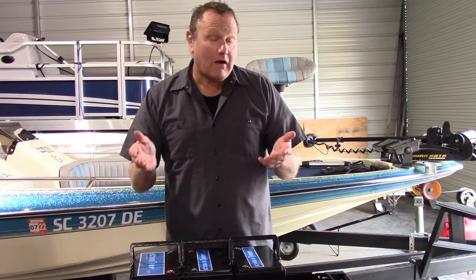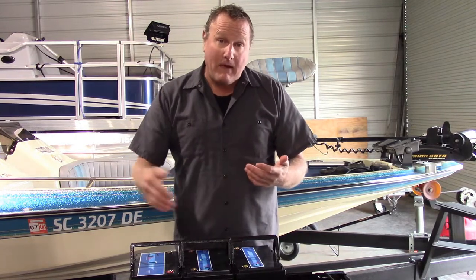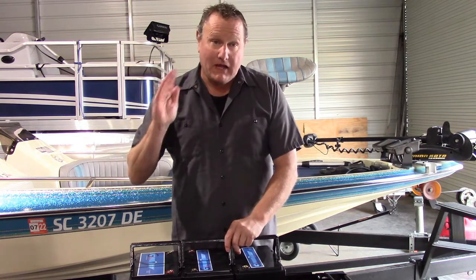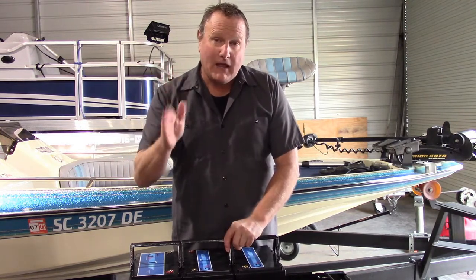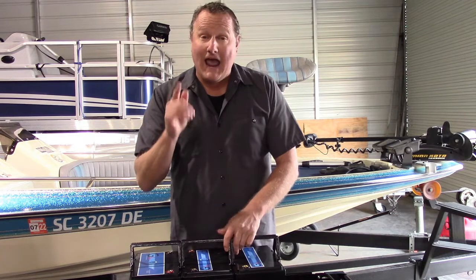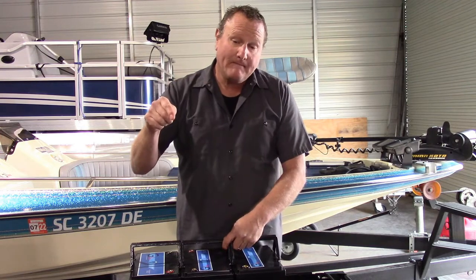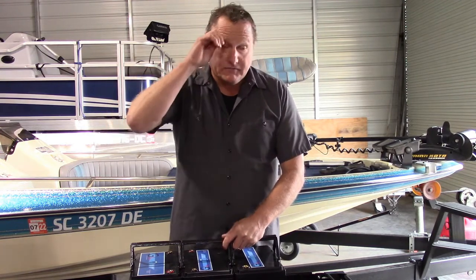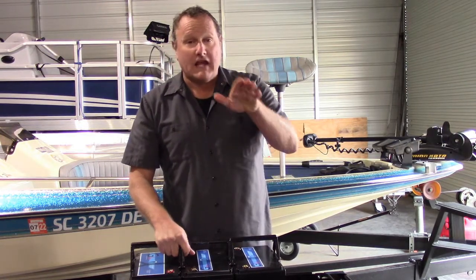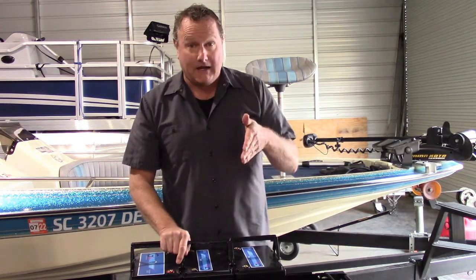So these charge-on-the-fly systems are great, but they should not factor into the amount of power you're going to need in the back of the boat. You have to go out with the attitude that you're going to run to a spot, get on the bite of a lifetime in current, and fish the same place all day with the trolling motor running. That's the attitude you have to have. And to be honest with you, that happens often. I'm not shaming the charge-on-the-fly programs — it just shouldn't factor into the amount of amps you put in the back of your boat. Again, to reiterate: you need 80, minimum.